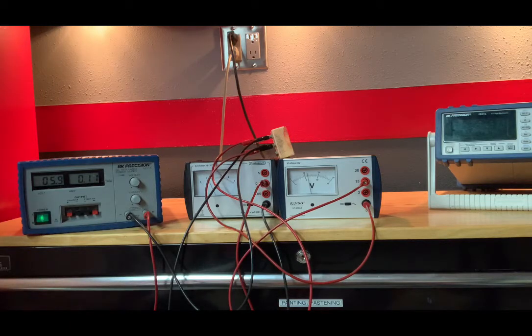The table we're filling out now is on page 32, table 7. We just filled out the value, scale, and error for VAB, or V red blue, whichever way you look at it. We also did the current for AB. The next row is RAB. From the instructions I've just read, they want you to determine the resistance of that combination of A and B, or red and blue, with equation 1, or Ohm's law.